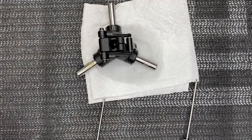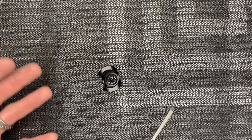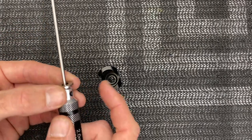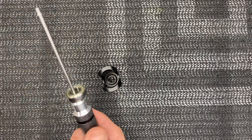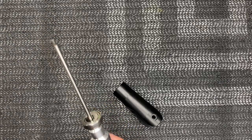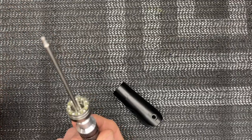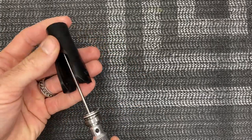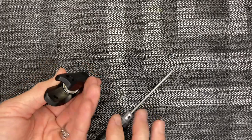Now assembling the blade grips — I'll show one, the other two are identical. This is a slightly different design. Assemble on a driver: first the washer that goes through the feathering shaft bolt, then the bearing, then the shim — the smaller ID — then the thrust bearing again, open side out, preloaded, larger ID. Slide this into here, drop the whole unit and assembly down, make sure it's fully seated.